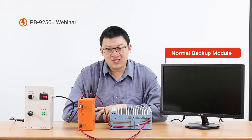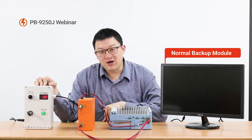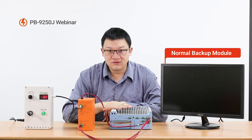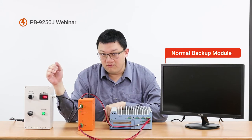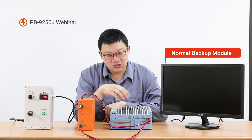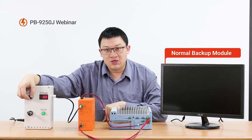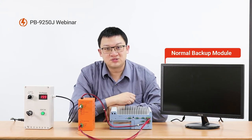After all those introductions, now it's time for a real demo. The white box here is our power supply simulator, this orange box is the power backup module, and this is the box PC. You always need to put the power backup module between your power supply and the box PC. You can see the two wires here — one sends the power-on signal to the box PC, and the other supplies power to the box PC. Now we turn on the power supply, and the computer starts up as usual.